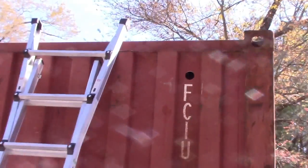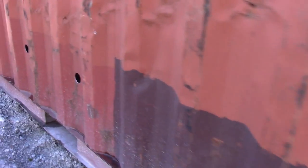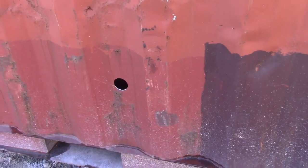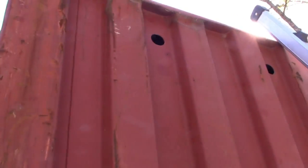I'm about to finish with the roof here. You'll see I already put some ventilation holes in the back. They're up high, and what you do is where the sun hits the most you put the holes up high, and then where the sun hits the least you put some holes in low. What happens is it will create a draft where it pulls the cold air in off the ground and pushes the hot air out up top. I drilled these out — it's actually kind of a bear to drill. They're pretty tough, but I'll show you this special hole cutter for metal that really helped, and I'll link it on Amazon for you.